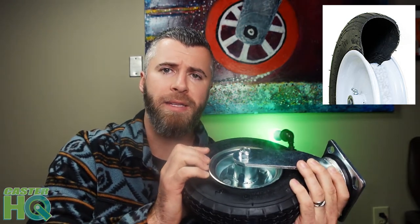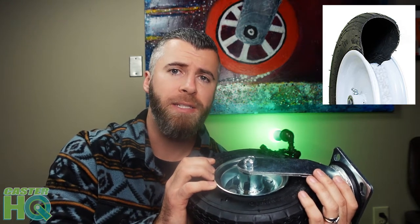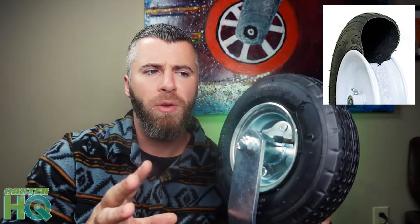These aren't known to have the longest lifespan — it doesn't matter where you buy them from. Air-filled pneumatic tires are definitely going to require a lot more maintenance, but it is the best tire for a lot of applications, especially if you're protecting expensive cargo. Now, before we move on to the semi-pneumatic or flat-free tires, we'll summarize the benefits of the air-filled pneumatic.